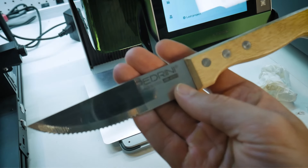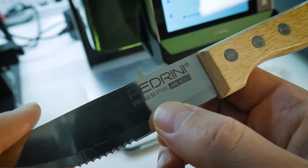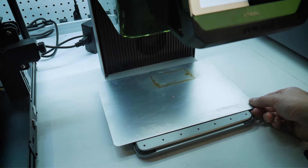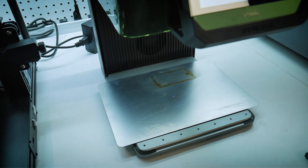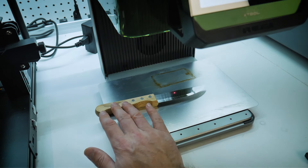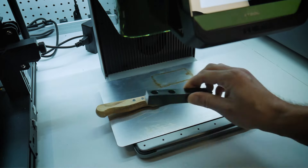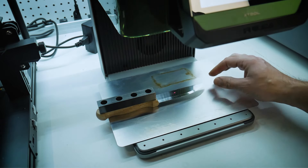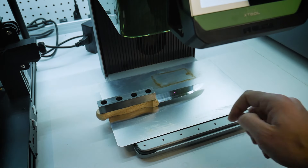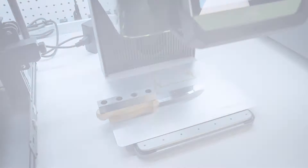I don't have a collection of knives in the materials we just tested, so I went out and bought some inexpensive 420J1 stainless steel steak knives to play around with. During engraving I'm likely to overshoot the edge of the knife, so I've put down a sacrificial aluminum plate on the work surface so I don't mark up my X-Tool F1 Ultra. When the knife is placed on the handle, it tends to tip over, so I've added a piece of steel to counterbalance it so the blade is parallel with the work surface.